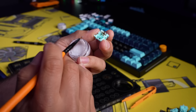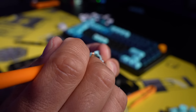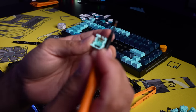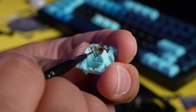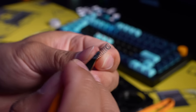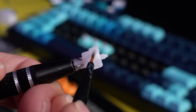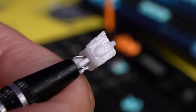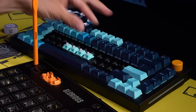For this switch I'm just going to act like I don't know what I'm doing and nobody ever told me not to over-lube a switch. Maybe we'll put enough that we could actually see a little bit of the white there, not just the clear. Let's dip again for the other side. Let's put a bunch in the middle here. Put more on the spring than we usually would. Let's just try to lube the entire spring, not just the ends. And then for the stem, let's pretend like we're frosting a cake. Oh, that's a lot. And yeah, I've never put this much lube on a stem before. You can like see it trying to seep out of the top there. There's so much.